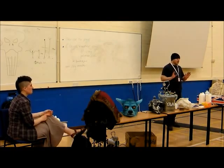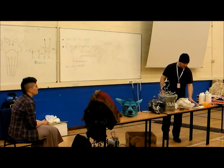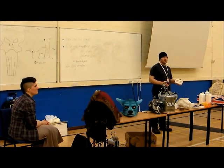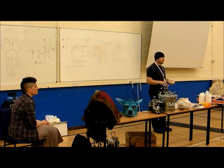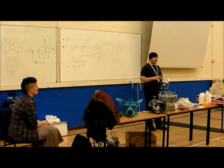Right, so your materials that you can make casts in. Very simple, first basic one: it's plaster. If you're going to do something like a latex object, or a silicone object, or to some extent certain other things, but you'll probably kill the mold in the process. If you soak the mould when you're doing something hard into it, like a resin or a hot glue, it'll possibly just about work, but you do run the risk of destroying the mould, locking nothing in and getting nothing. I've done that before.